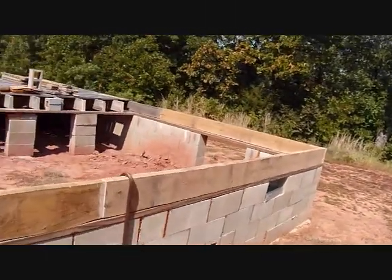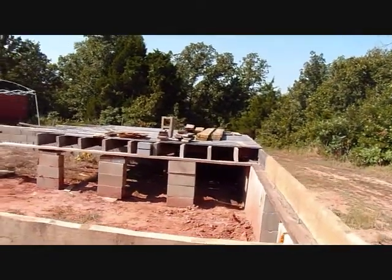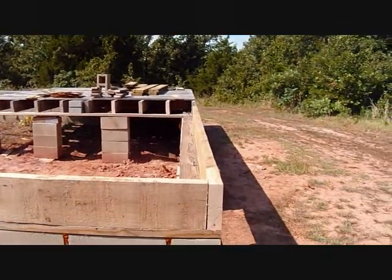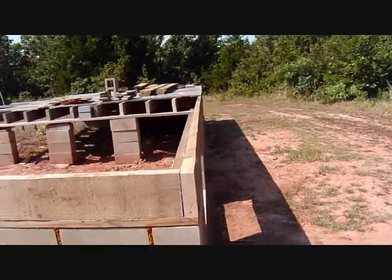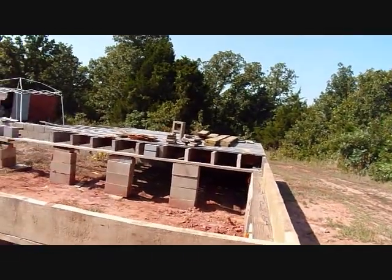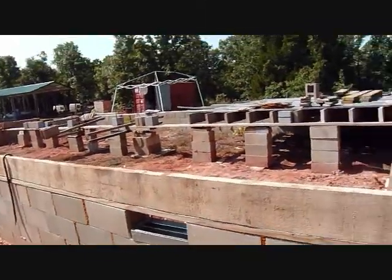So now I'm going to start cutting the joist. So I've got to measure my 16 inch centers, because that's what I'm going for here, 16 inch. Could go longer with this big of wood, but I don't want to. I want it to be solid, which it's going to be, lordy, it's going to be. So anyway, got that. Looking good.